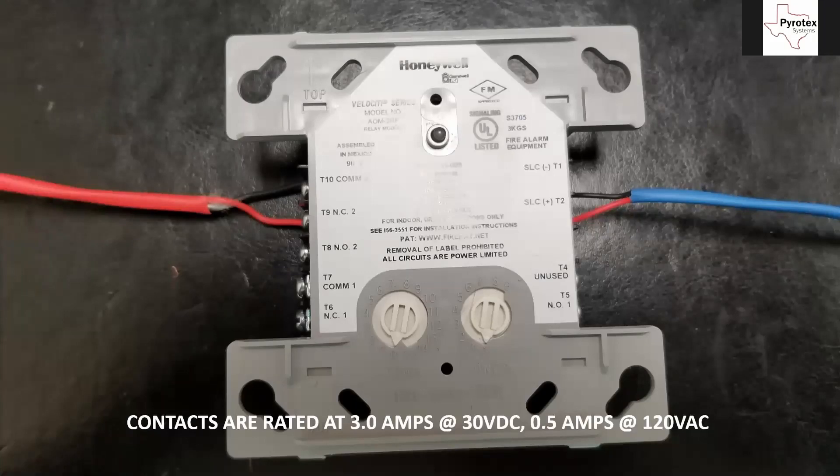Here's the same picture used last week. It still applies because we still wire common and normally closed if we're using just an addressable relay to control these dampers. The dampers are normally energized — we're normally allowing power to pass through them that holds them open so the building can breathe under normal conditions. When we cut power to it, the damper will close and it'll start doing its smoke control function. Since we normally want them energized, we're going to use our normally closed circuit.